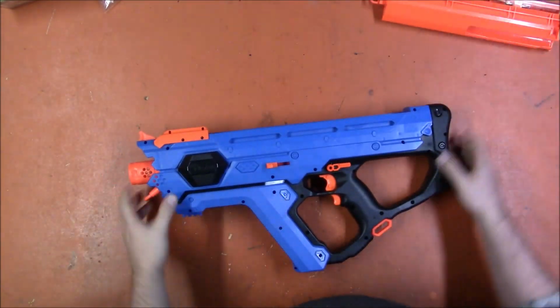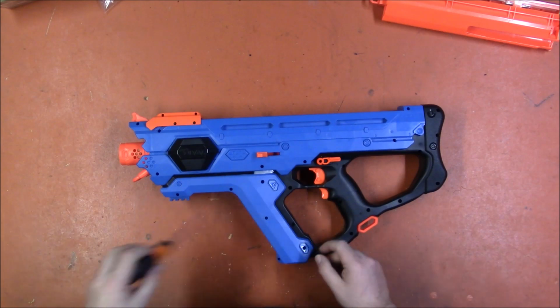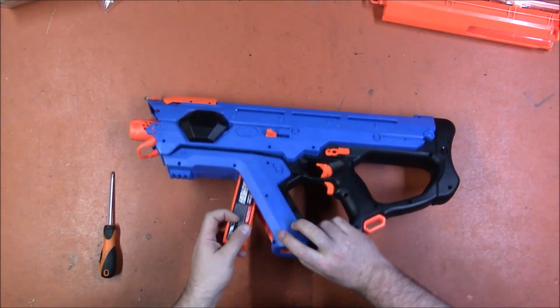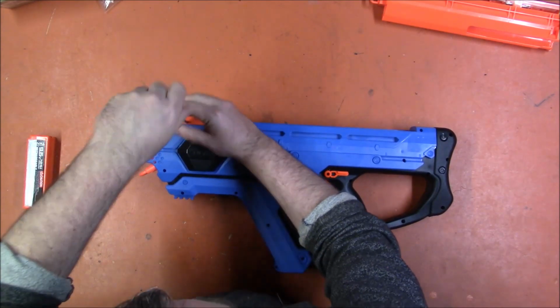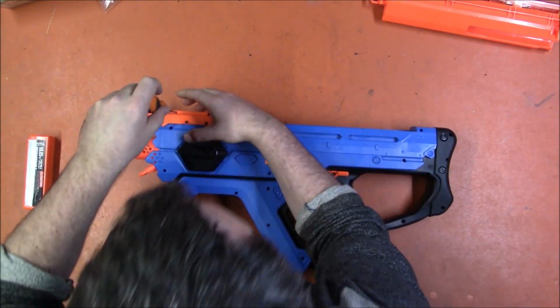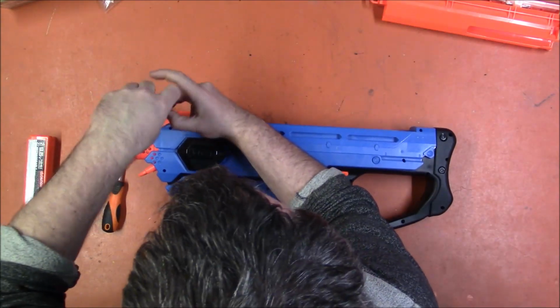I saw it on, I think, a Hera that someone sent me. The board that the thing was soldered to, one of the solder joints wasn't quite good enough, and as a result, it wasn't quite connecting. Sometimes it would, sometimes it wouldn't, but it was a simple matter of going in and fixing the solder. So hopefully that's the case here, but we're going to find out.